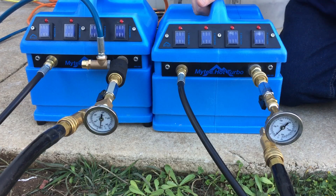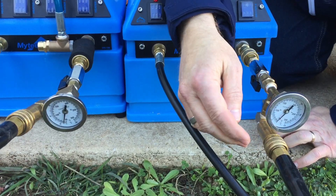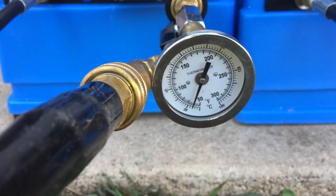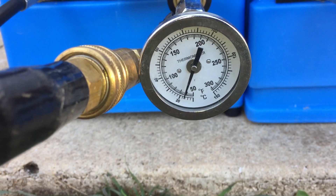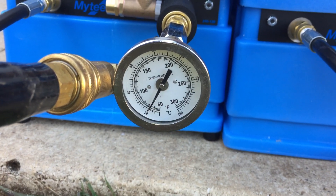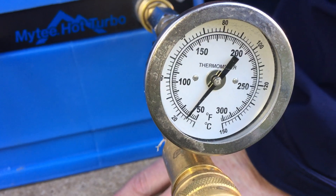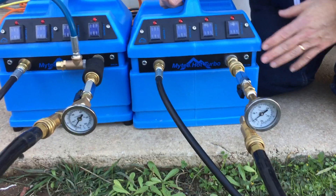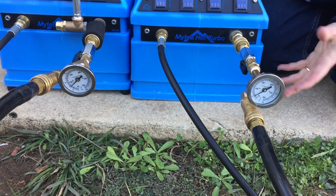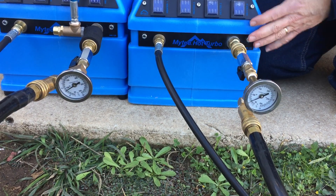It may not be very exciting because normally you're stroking a wand. What's on the end of these is an O-1 jet spraying full-time, so the water's in motion. Normally you're cleaning carpets — a rinse stroke and then a dry stroke. This one is definitely making an improvement: it went from 55 degrees to already 70 degrees coming out, and this one's up at 60. Normally, if you feed these with hot tap water that's been running through your carpet cleaning machine, most people experience about a 25-degree rise with a heater like this.